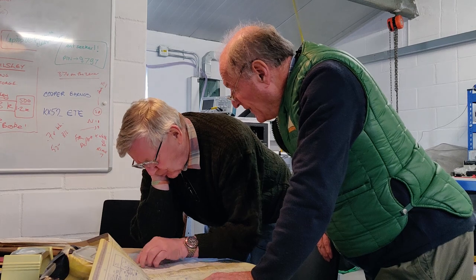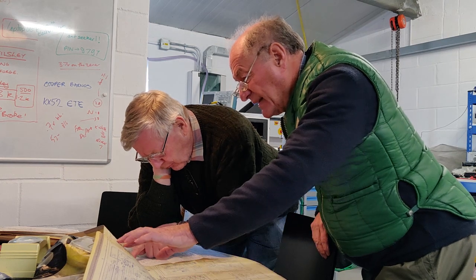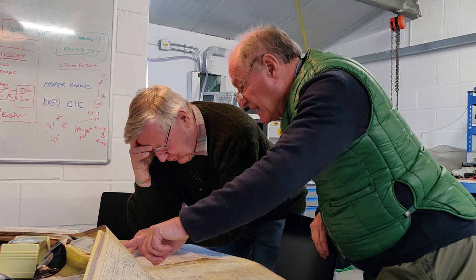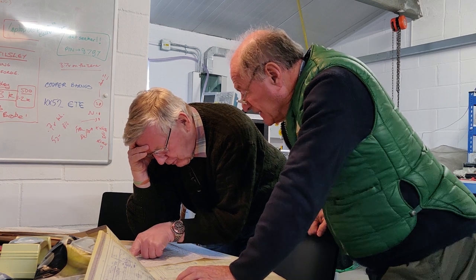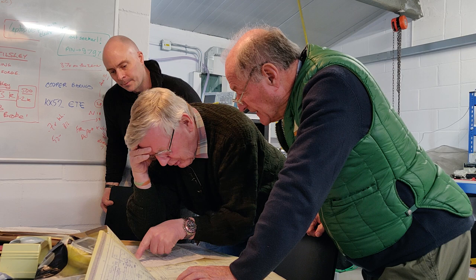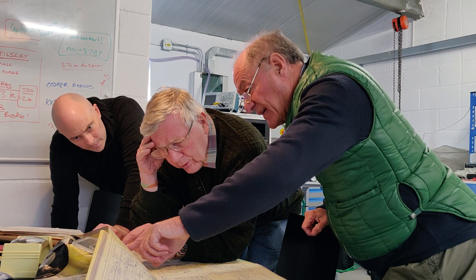So this is the crucial thing. Filament drive goes out on 2B and 4D and 3C. So there's a bifilar transformer there with 32 to 16. So it's got a higher current output going out down, which will be AC, a switching square wave, coming out down those two. So does that make sense? 2B and 3C there. 2B.